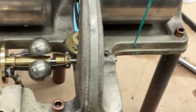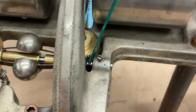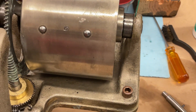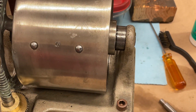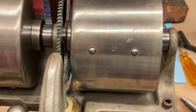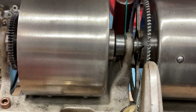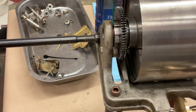Then we're going to come to the back of the machine and do the back right here — just put a little dab of oil there. Now we're going to come up with sewing machine oil and add oil only right here where it runs on the casting. Because the whole system pivots — this pivots, the springs pivot, and the spindle shaft pivots. So we put a little dab here, run down the motor, and put a little dab in the center casting right here. Then we flip right over and put a little right here. And then we come over to the winding crank mechanism and put a little dab down right in here.